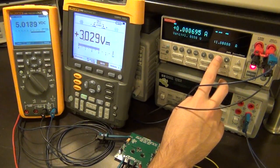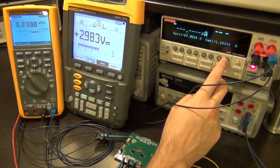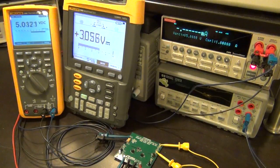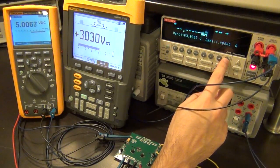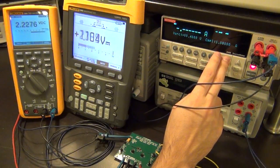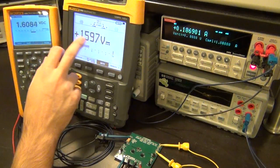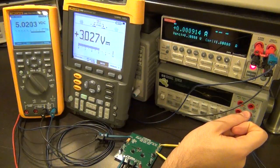I'm going to continue to go up - at 1 volt, 2 volts, 3 volts, 5 volts, which is the maximum. So I'm sourcing 5 volts to it, no problems. I can go back down all the way to 1 volt, 0.4 volts, 0.3 volts like before - no problem. I go down to 0.2 and it loses regulation. So if I go back to 0.3 volts again, you can see it kicks back up to 5 volts and 3 volts. Without any load, it's working really well.